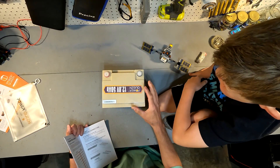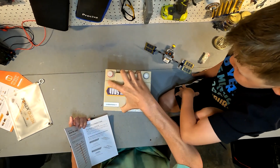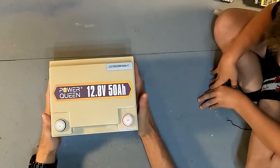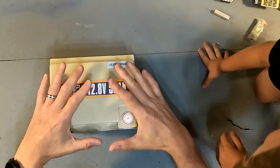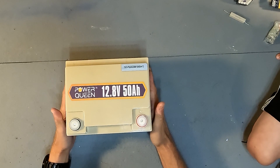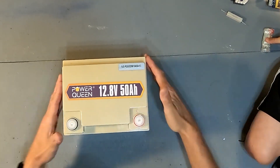You can see it's actually pretty light — we don't need a carrying handle, we can just pick it right up. Here's what the battery looks like when you first get it. The battery is 11.57 pounds, which is very light for 50 amp hours of usable capacity. A lead acid battery giving you 50 amp hours of use would weigh roughly triple this.